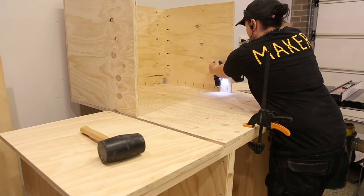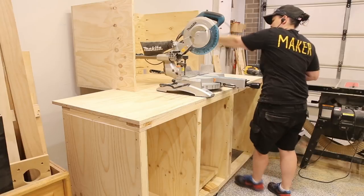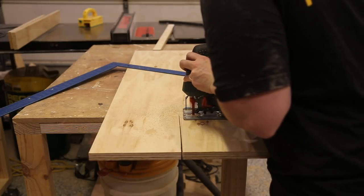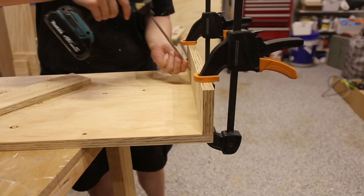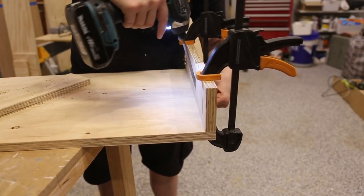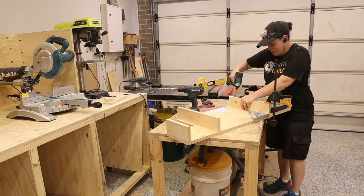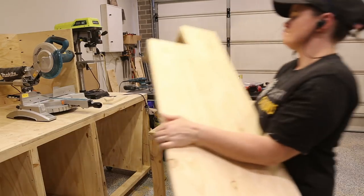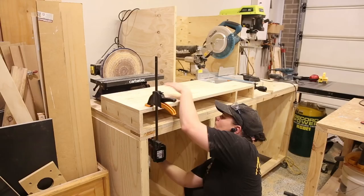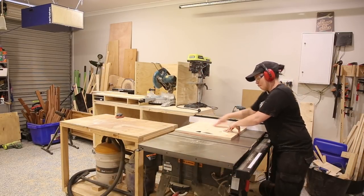With the box centred on the workbench I tested the saw and everything was working well, so I turned my attention to the miter saw wings. I cut each of the wings and notched out a square to fit around the miter saw. The risers will be different for everyone — it comes down to the height of your saw. You just need to take the measurements and account for the thickness of your plywood on top. The two middle risers I cut short so I could put a back piece in, which stops sawdust from getting in and makes the underneath sections more useful. I attached the wings with pocket holes on the outside and also screwed in from under the frame.